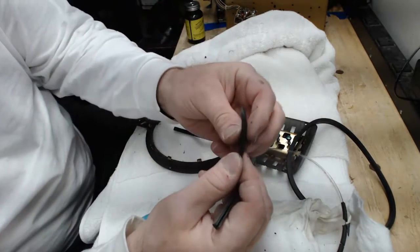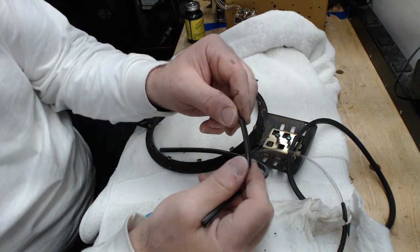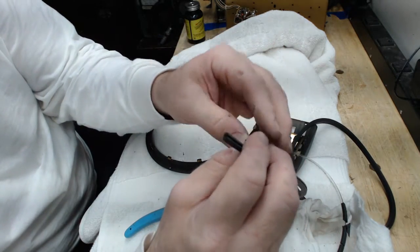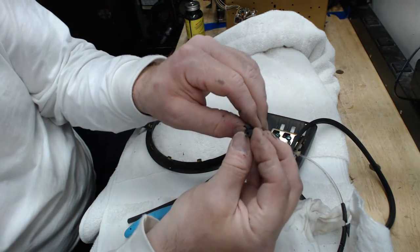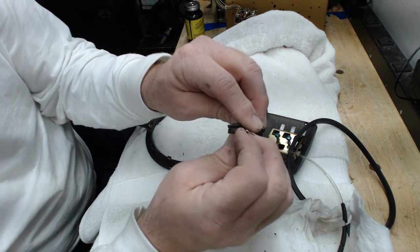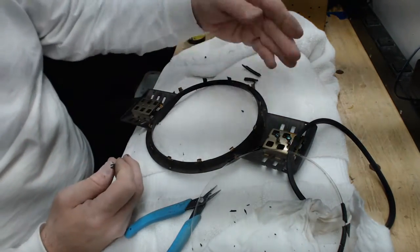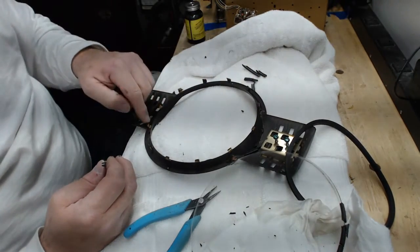And here, check this out, man. I can get new gasket material, but it isn't quite the same size. The new gasket material has a deeper channel and it's a little bit thicker rubber, so it doesn't quite fit as well as the old gasket material. I mean, it'll fit on the glass, it'll stay on the glass, but because it's taller, it takes up more space, and that's why I wanted you to make sure you bent those tabs back enough. You don't want to be bending the tabs back and forth, so you just bend them back far enough on the first shot.